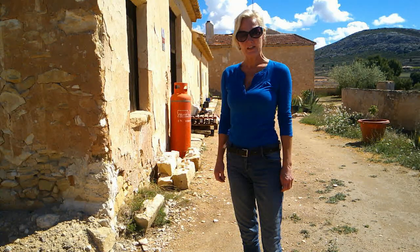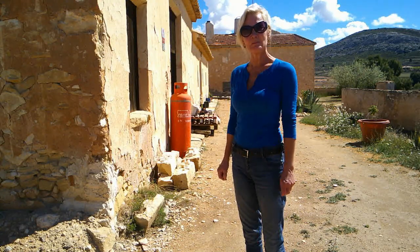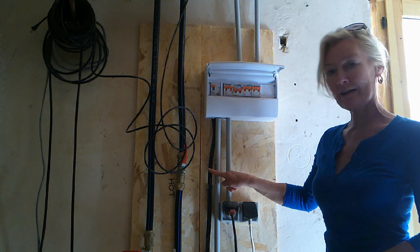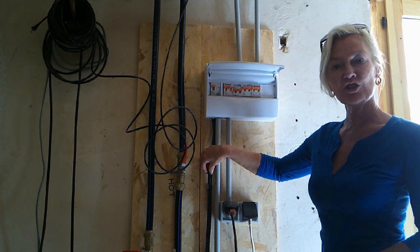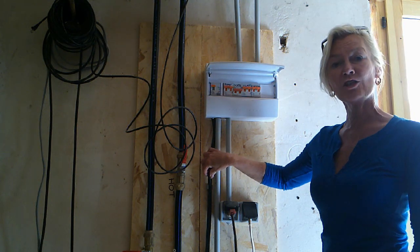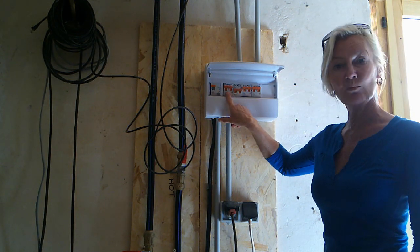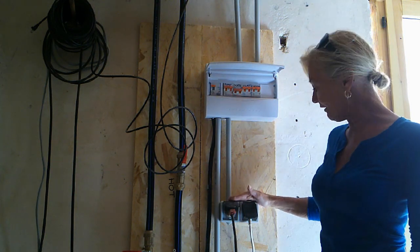From our water video you may remember Eddie came in to dig a big trench all the way along the front of the house for water pipes — but there's also an 8mm armoured cable that comes from the workshop and solar array all the way to the house underground. It's armoured because it has a really tough outer coating and a metal sheath inside that the three wires run through. It's 8mm because it has a long way to travel, so we don't get a voltage drop. That goes into the second consumer unit. This is the main RCD switch. This circuit is for the sewage pump, which will be covered in a different video. This is for the house sockets — at the moment we just have two and are running off extension cables.